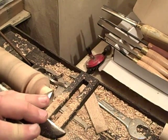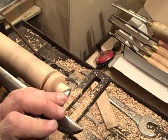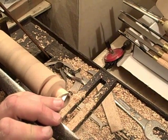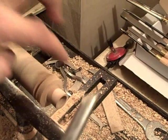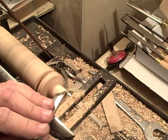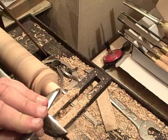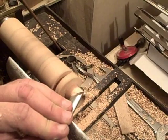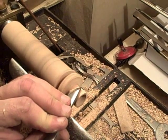Okay, let's take that down into the corner. What you want to do — if you've seen any videos or had any instruction on using the skew — well, what you want to do is catch it just so it's skimming over the surface. Put your skew on top of the piece of work if you can. I think this thing needs sharpening, to be honest with you — I don't think I've sharpened this one. Just catch it in that lower quarter of the blade, and then just run that smoothly along there, pressing down on the top like that.